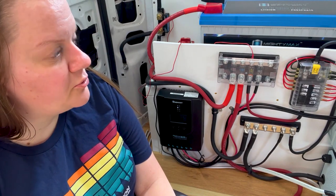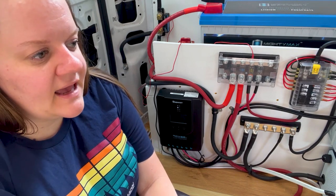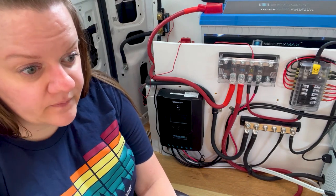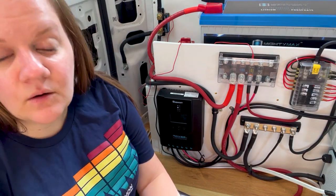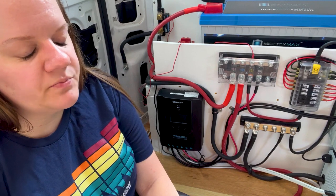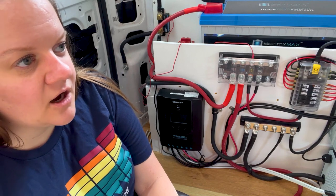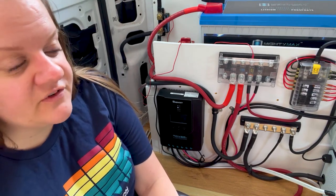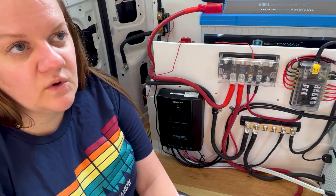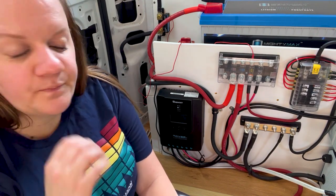So you guys saw me do the pre-wiring. If you didn't, here's the video. I decided to do the entire system with 12 gauge wire. The reason that I chose 12 gauge, it's honestly a lot too large for most of what I'm doing, but I really didn't want to be in a situation where I was trying to figure out, okay, I need 30 feet of 12 gauge, I need 10 feet of 14 gauge, I need 50 feet of 16 gauge. I really didn't want to be messing with that. The price differential between them was negligible. So I just went with that.